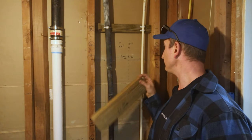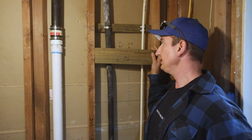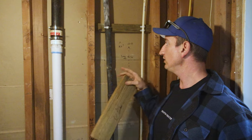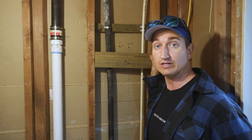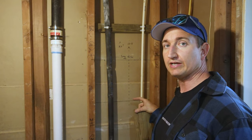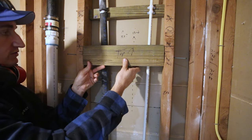I'm also going to put some blocking in here, which will allow me to screw the mounting brackets into wood framing rather than drywall anchors. Since I have the opportunity, I might as well do it. I know where those anchors are going to go — the brackets go right under here — so if I put a block somewhere in this area, the mounting bracket should tie into it nicely. I'm going to put the outlet box here, a framing member here, and another one down here for the tie-in safety bracket, so I'll put two blocks in.